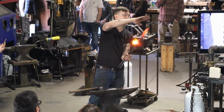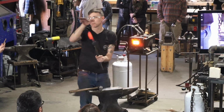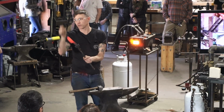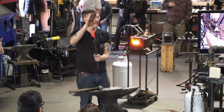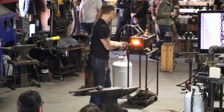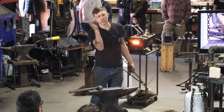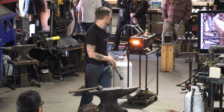my point back. Now, some people forge the same knife enough to where they know exactly how much to forge it forward, so when they forge the bevel in, it just goes right where they want it. But generally, I'm not doing the exact same knife over and over, so it's kind of hard to tell. But you can also just bevel, correct, bevel, correct.